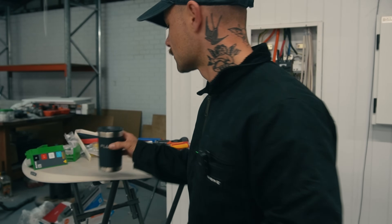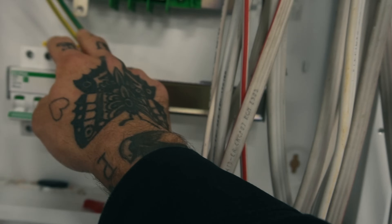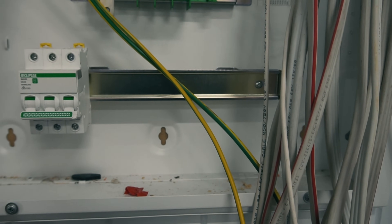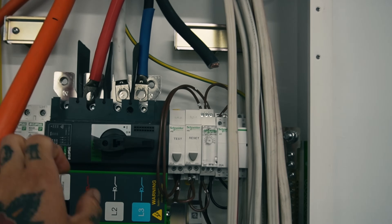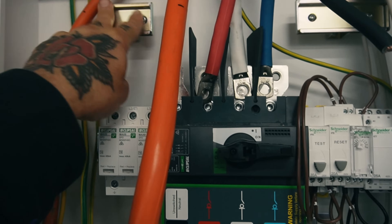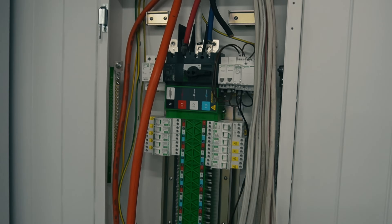The good thing is we can run straight off the bottom here and we can feed - I think five, five, three, three CBs down there. And if we did our RCBOs, I'm pretty sure the RCBOs fit in the chassis. You've also got DIN here - one, two, three, four, five poles. And then you've got the same here - I think that's like three, three DIN and then four, four here. So there's a heap of extra DIN on there compared to other boards, which is really good.